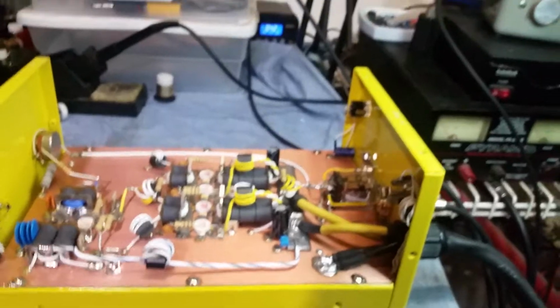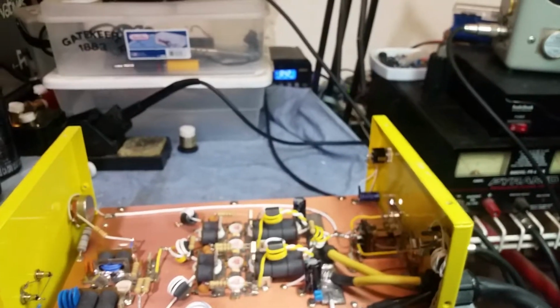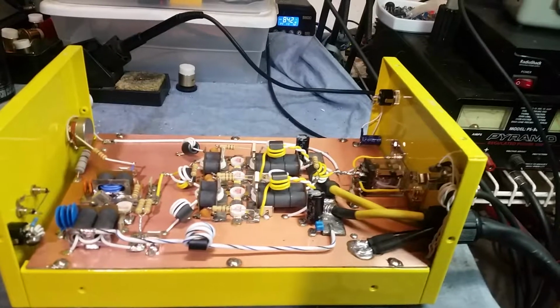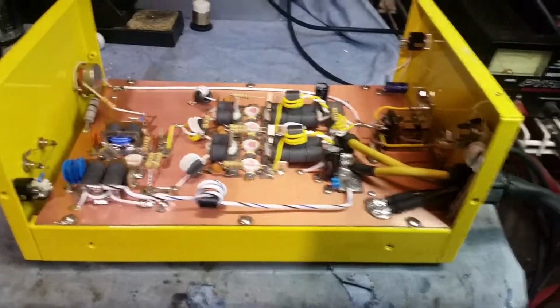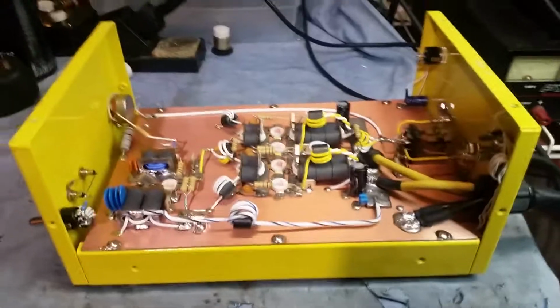Alright, we've got her hooked up on the 100 amp unregulated supply over here. I got it on the medium tap at first, because we're just going to hit it with the bench radio first. If it's on the high tap with the bench radio, it don't really pull it down too far, about 16.5 volts. So I'm just going to hit it on the medium tap first, and we'll switch it over to the high tap and hook up the hot radio. And I think I might even burp it with the hot radio, the D-Rail modded 29, the big monster. Just a quick burp though.